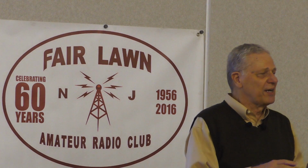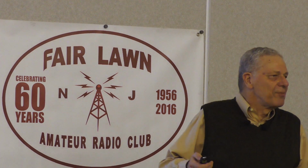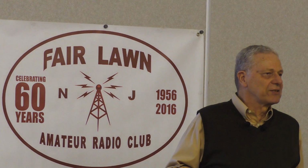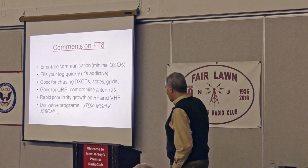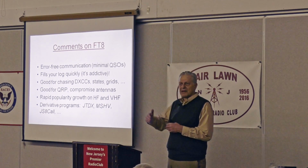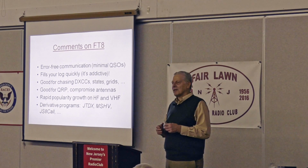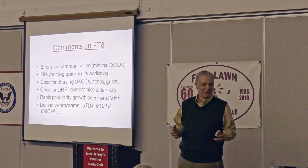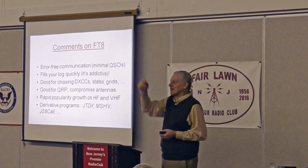But stuff that we have under development, we have one level of protection on. So you can't go copy that, because among other things, we play around with different possibilities of the number of bits and exactly how they're decoded and this and that. Until we make it final, we don't want it to be on the air, except maybe to make a few test contacts ourselves. So anyway, this one called JS8Call is of interest to some people because it allows you to string together a whole lot of sequential FT8 messages to carry on conversations that actually have whole sentences in them, or maybe whole paragraphs even. It takes forever, but you can do it, and some people have had fun doing that.